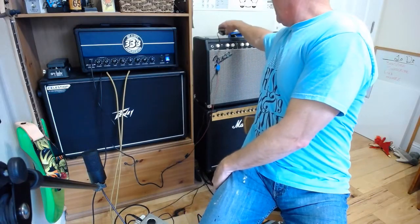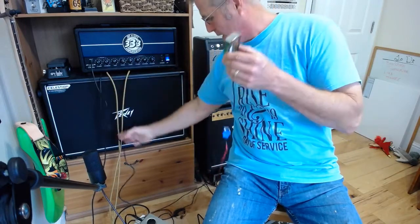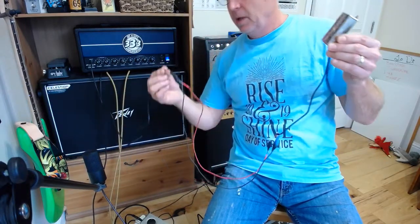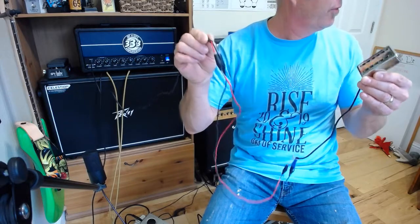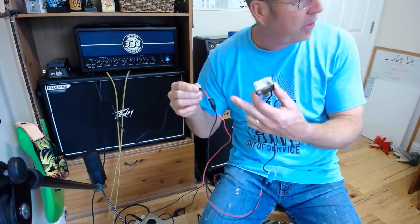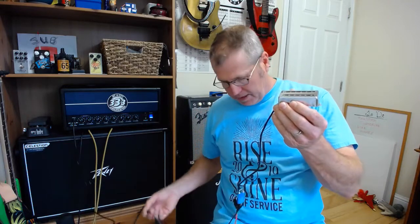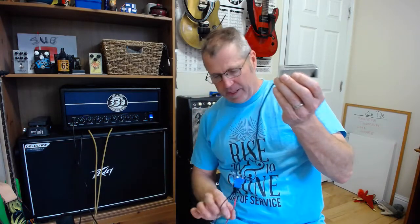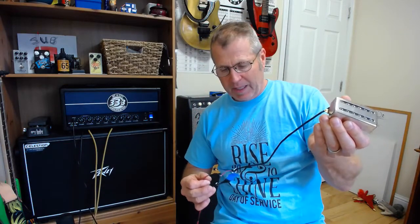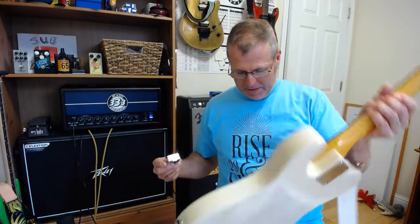Go ahead and hook up this pickup. So I've got a speaker cable, an instrument cable with 2 leads, one red, one negative, soldered up the end of the wire, so there was plenty of solder on it, so that the alligator clip would grab it nicely. Then I just hooked the other ends to the appropriate wire over here. Got my painter's tape to prevent a cross short circuit.